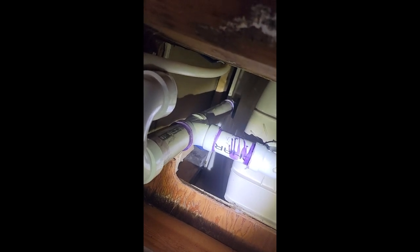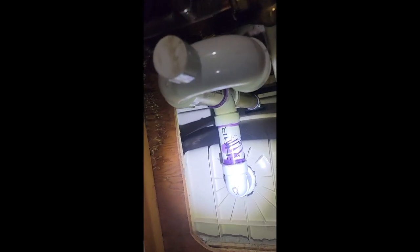I can see way up there that it's clipped to the wall stud, so it's a direct mount. So if I can get the surround screws or nails — whatever that's held on with — out, I might be able to remove the shower walls in one piece. That mortar has me bothered a little bit. It's great to have mortar for setting a tub, but not to remove a tub. It might come out in many many pieces.